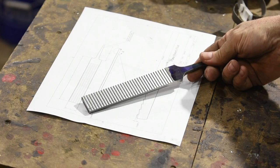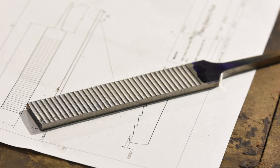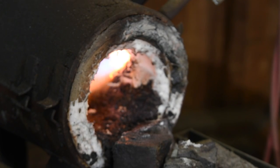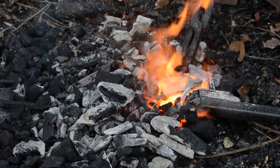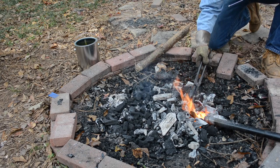The float is now ready for heat treating. Heat treating is necessary in bringing the steel for all cutting tools to its maximum hardness — you can't just machine it and leave it. In this case, I'll be using a blacksmith forge to heat it. If you want to try something similar at home, you can just use an acetylene torch or even a backyard charcoal grill. I've got a video on how that would work — click the link for details.